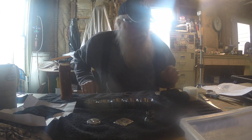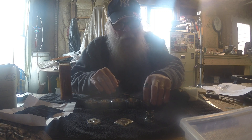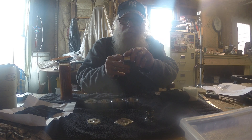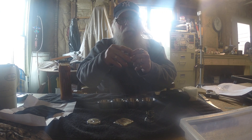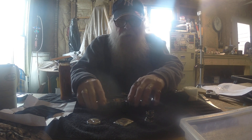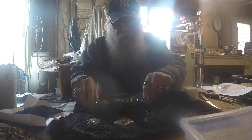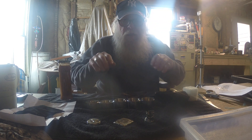Hi folks, this is the Colonel with a little show-and-tell. I got three different things. First, I got these new 17-degree reduction dies — a set of five of them. It starts at one point six inches on the big side and goes down to point seven on the small side. I got them on eBay, got a pretty good deal. For any potential ring-makers out there, go with these 17-degree dies — I think they'll work out better than the 25-degree unless you're really trying to make a fat tire.